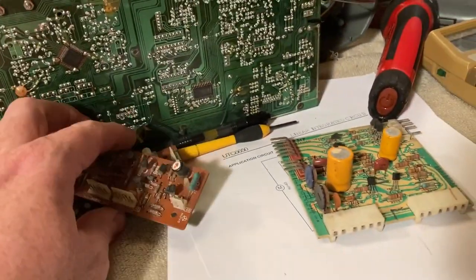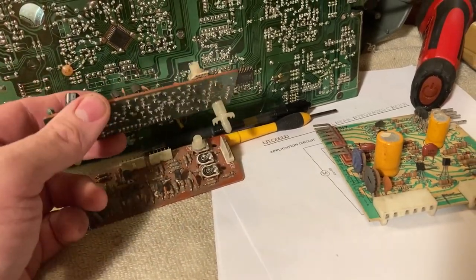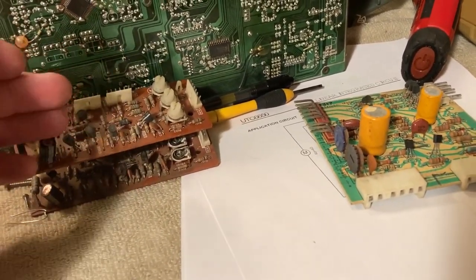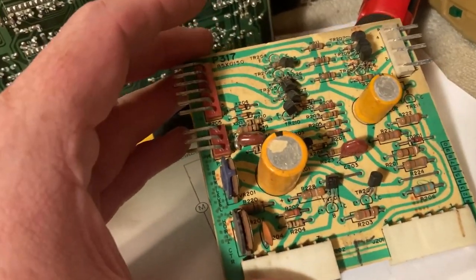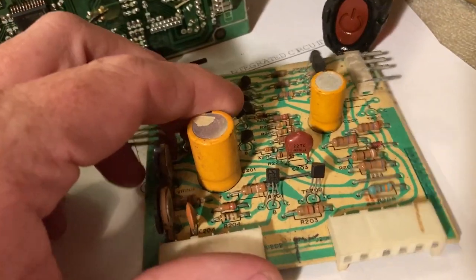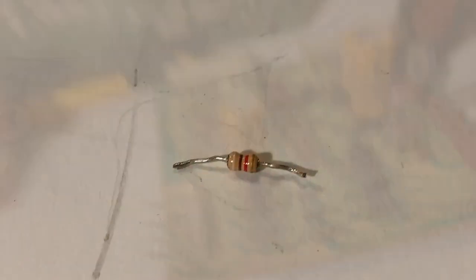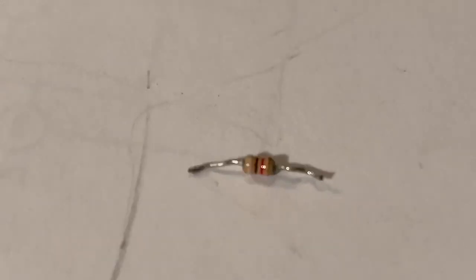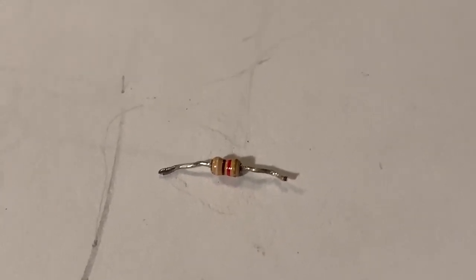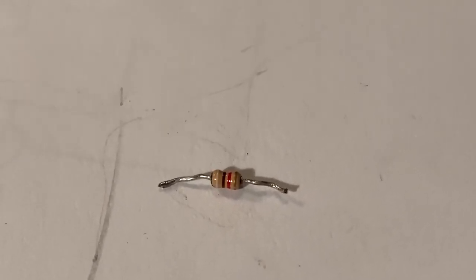I've got some parts boards — I don't want to take parts off these permanently, but I don't have any loose resistors, so I'll order some. I've got boards from Nintendo Sanyo monitors and a Wells Gardner 4600. I need yellow, purple, brown — that would be 470 ohms. I can't even tell what color that resistor is. I think it's white, black, red. Let me look that up and measure it and see if it's anywhere near that. I've got that all completely backwards.